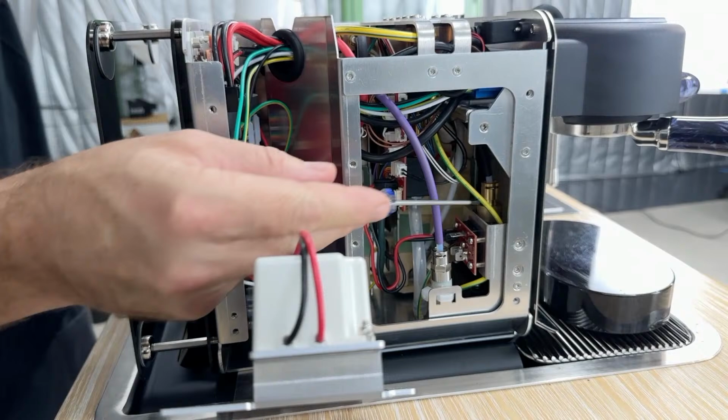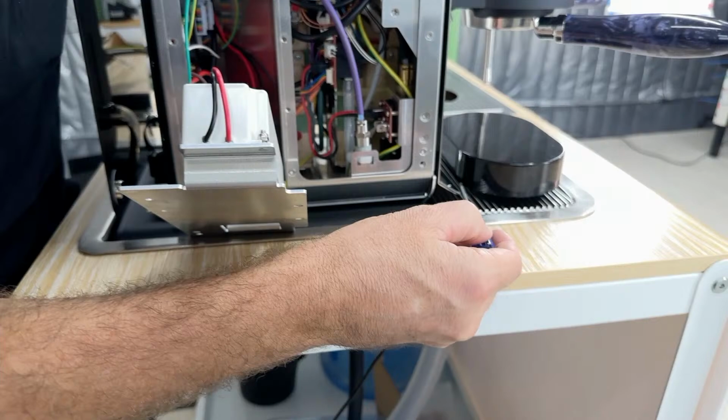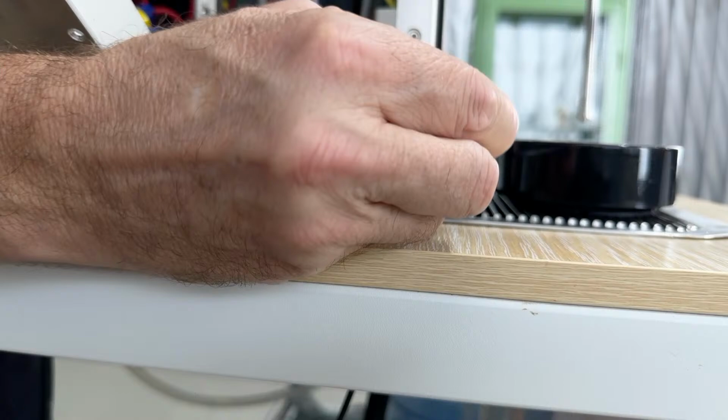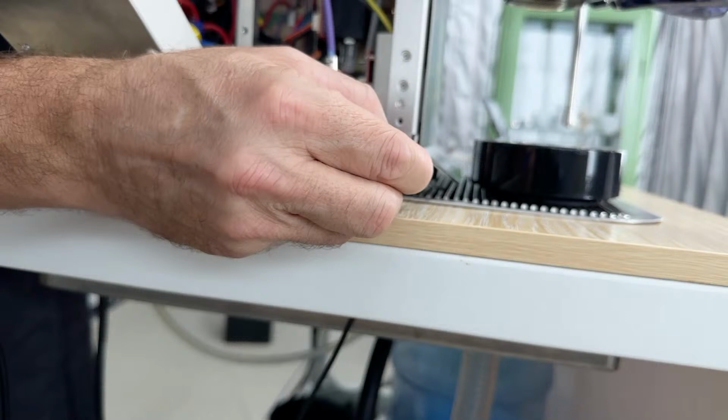So over here is what's called the flush valve, and this flushes out here. Now, one of the things we've done that we're pretty proud of is this mirror here is hiding something. Now, can you see with that camera, Paul? You've got a little flush that comes out here. Now, in a lot of espresso machines, this comes straight from the top into the drip tray and kind of splashes you. What we did is direct it into the drip tray directly with this mirror hiding it.